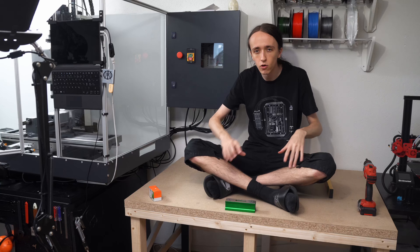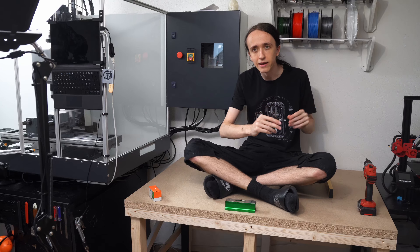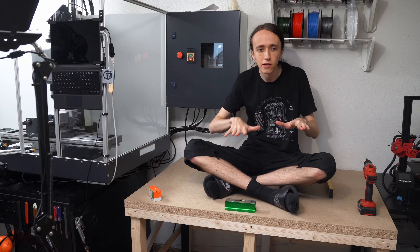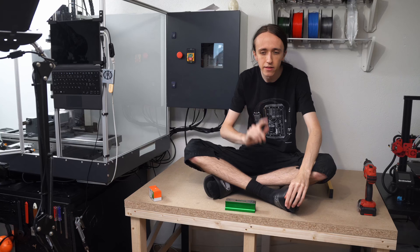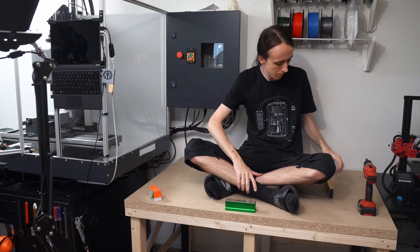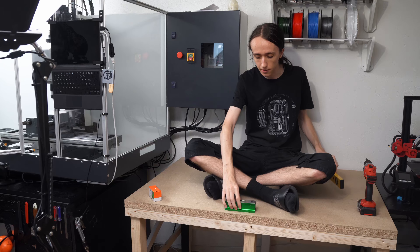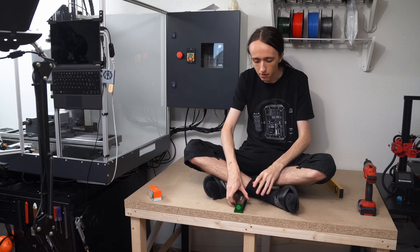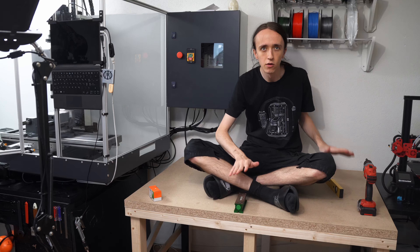Once I put the machine on top, I can also level the machine perfectly everywhere, and I can put the level on top of the gantry and level the gantry — this way I can very easily make sure that it is all nicely parallel and not twisted without needing any fancy tools. This does mean I'm going to have quite a bit of fun shimming all six legs here. Using the standard level, I put it on and it's already dead nuts, but putting the machinist level on, it is basically at its maximum and not even reading properly because the bubble is already off the scale — that's how much more precise this level is compared to a standard one.